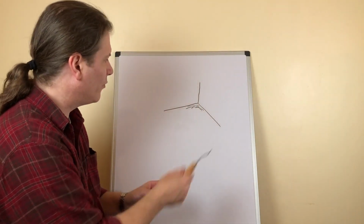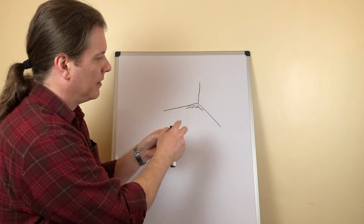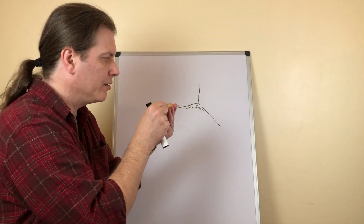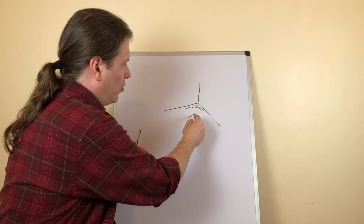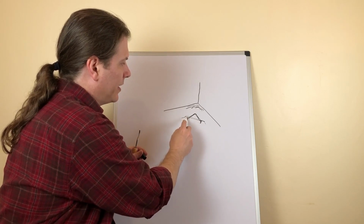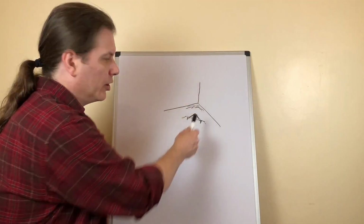Let's consider if we did take this in straight to that corner. Then what's going to happen is, since this plane, the top, the non-bevel side, is at, let's say, 0, depending on the angle, there's a certain depth at which the corners of both cutting edges will disappear. And then you're more likely to pry up. This point would gouge in, and then these corners would disappear below the surface of the wood, more likely to pop out grain on either side of it as this was covered. You see what I'm saying? So you're fine as long as the wings are out, but once the wings both go below the plane of the surface, not so good. Not so good, because you're no longer cutting, you're prying.